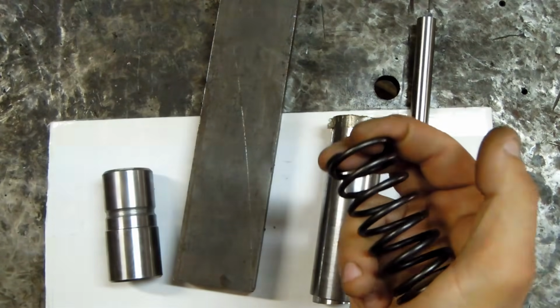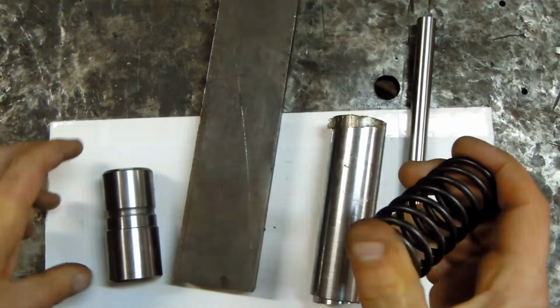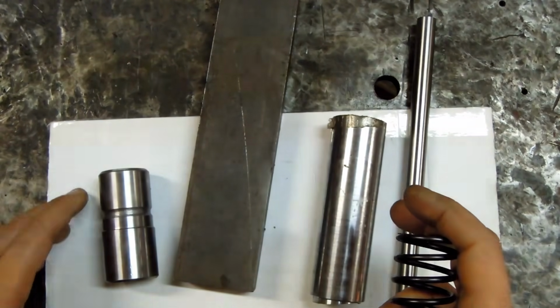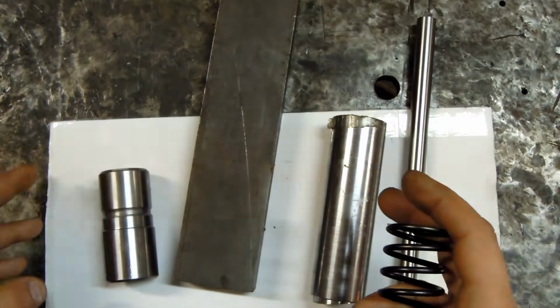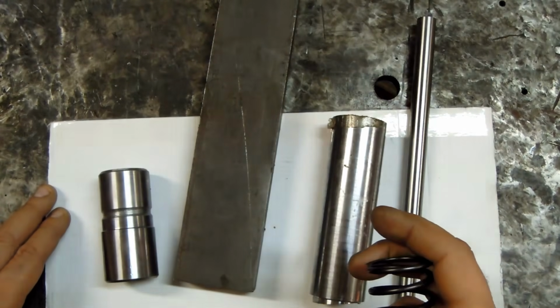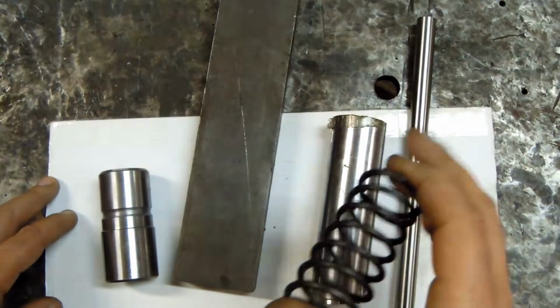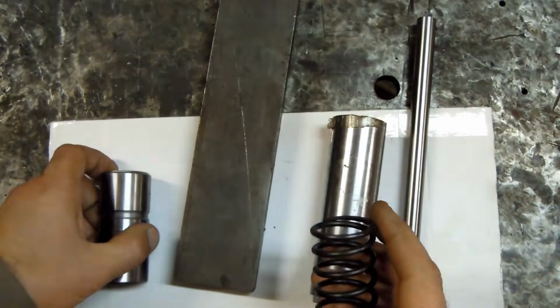This is the biggest spring I got, and I'm thinking about using it as a kind of a stripper. I don't know what thickness material I have, but I have an idea of the average, and that's what I'll use to add clearances to the die. But I thought this might be a little more handy than, say, a fixed stripper plate.